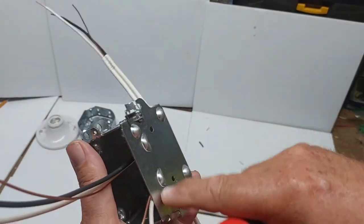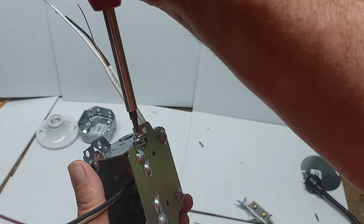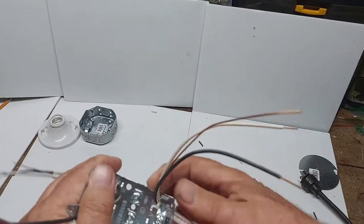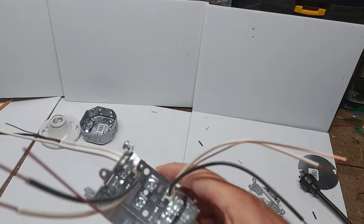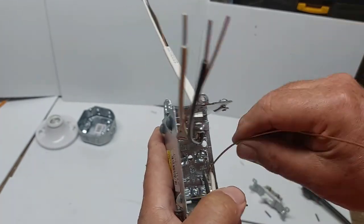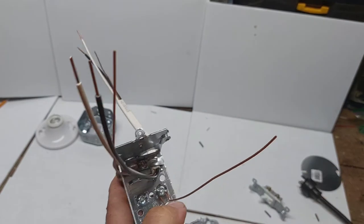To show you the ground being hooked up, I'll take the side plate off so you can see it better. Loosen the screw on top, slide it out from the bottom, turn it and it slides off. Now you can see the ground screw. I'm going to hook the ground wire around that screw in the back of the box — loop it the same direction you'll turn the screw, then tighten it down.